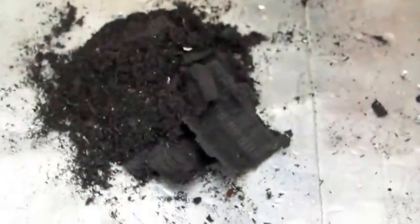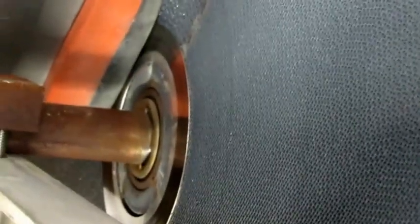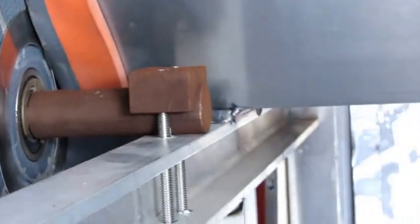Okay, so we're going to prep to take this dehumidifier wheel out of here, and I got some special tools to do it. It might be a good idea to have a small shop vac or something, because you see I scooped up the remnants of that belt. Don't want to leave it in there. A couple things I want to point out to you is this right here is a kind of a shaft block and lock. It's bolted in right here. The desiccant rotor is on bearings right there. There's a C-clip right there that we got to get out, and there's another C-clip right there that we got to get out. And you can see how we got to take those bolts loose right there. Everything on this thing, by the way, is 7/16, and so quite nice to get to.